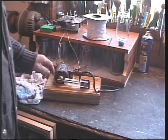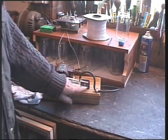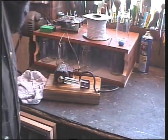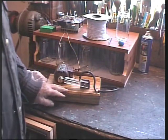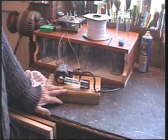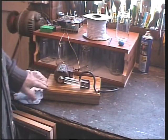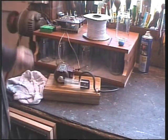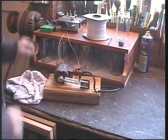I'll go about that O-ring in a minute. In this we've got something like three-quarters of an inch, maybe an inch of crank. It's pivoted at this end. We have some cross-drilled holes and a hose coming out this end — this is just temporary to allow this to oscillate. I've got a box of O-rings — I think there's 7,000 in the box ranging from one-eighth up to an inch and a half, made in China. They didn't last two minutes, so that's a second-hand one that came out of a pressure washer, and that's hung up quite well. I've connected this up to a light dimmer switch, and you can see it's simply a piston going up and down. I can control the speed of this when we dim up.